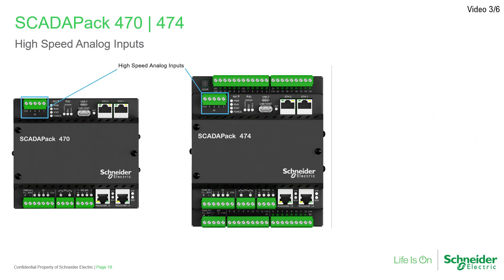The CPU board is also home to four high-speed analog inputs for use with control applications such as rod pump controllers. They are fast setting, providing 30 millisecond updates on all four channels, or slow setting, providing a 100 millisecond update rate with higher stability readings due to filtering.